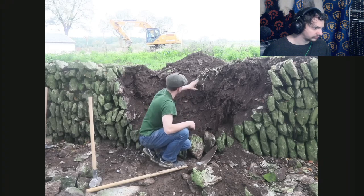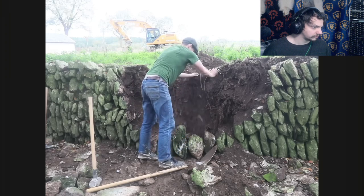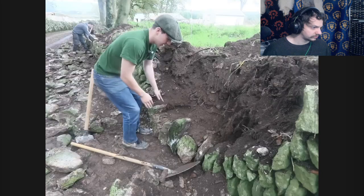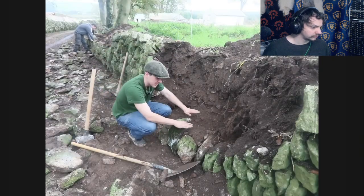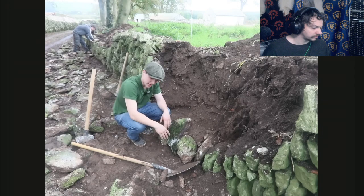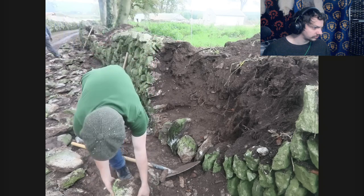So to pack that up, I'm just knocking down some stones from above. Get a bit of that soil there, whatever else. Now you kind of want all your stones sloping inwards, just a small bit. If they're sloping outwards, it'll just mean the stones on top will also slide down them. So you just want to be a bit careful, take your time picking out the stones.